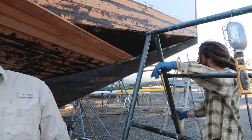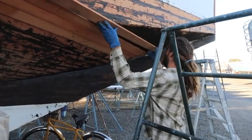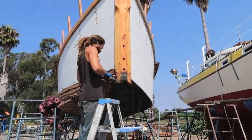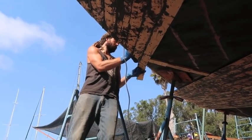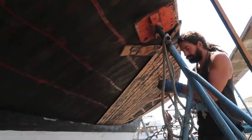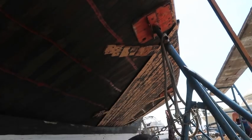One more? Okay, I think it's in your hand. Good, because that's how many we cut. Perfect. Doing several planks at once really sped things up. And like Tyler said, any little discrepancy can be remedied with tar. We completed up to the bow, then another full day of trimming the overhang. We put spacers to reserve the spots for the planks that will go where the stands are, which the yard will move all at once when both sides are sheathed.